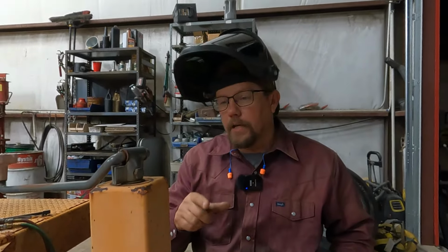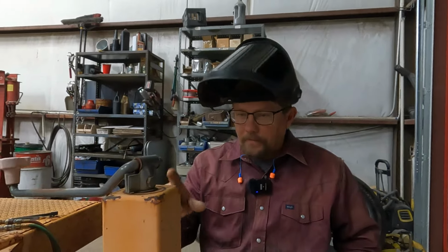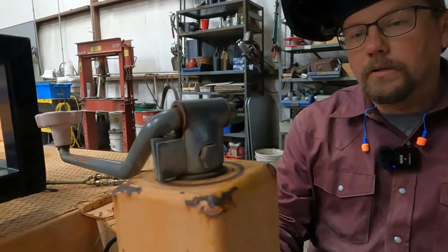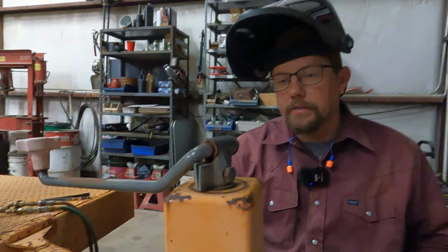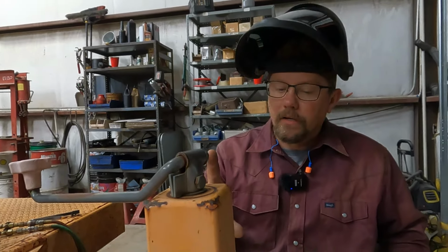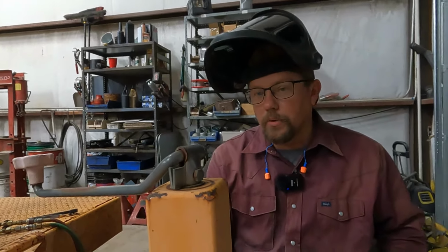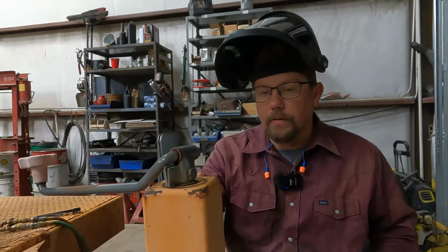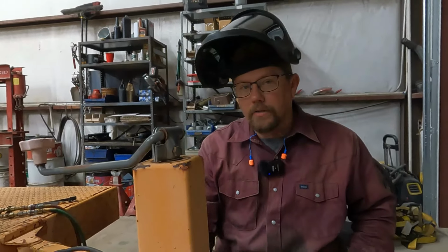The last thing I will say before we cut this: when you're cutting a jack, these will have some grease in them. Most people don't grease these on a regular basis like their Easy Lube axles. They grease them every 4 or 5 years, whether they need to or not. But there will still be some residual grease in here, just like in an Easy Lube, even though nobody's put any grease in it anytime recently, and that will catch on fire.